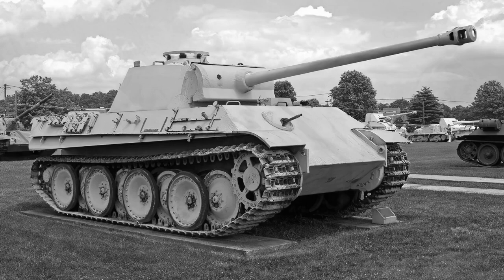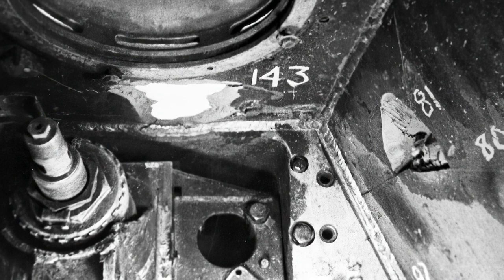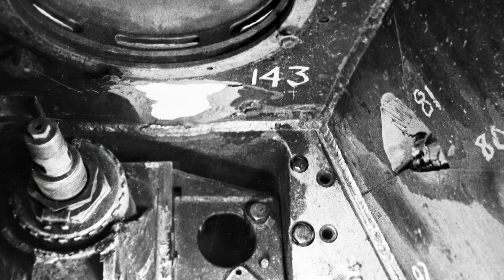In order to get a seam that would work well, the Germans used stainless steel as the bond, which gave the only flex possible. The results from these impacts were catastrophic: as the shot traveled through the armor, the metal around the shot could not compress as quickly as ductile steel and would split along the crystalline layers, often for several feet. The inner layer of the armor, even if not perforated, would also spall as the shock waves hit the void and reflected back. These waves would overlap and form a tension wave which could not disperse and would tear a chunk out of the armor, which would then ricochet around the hull, mincing the crew.